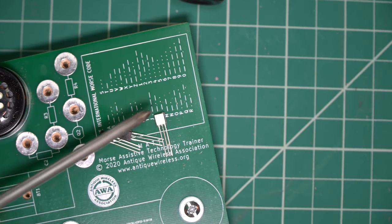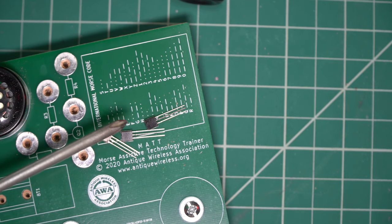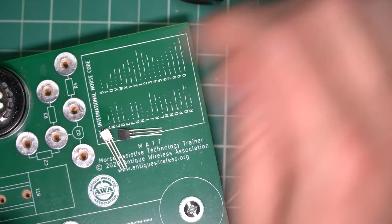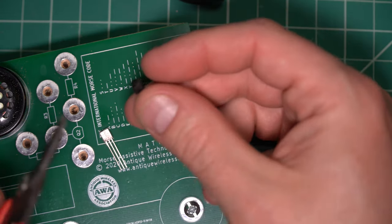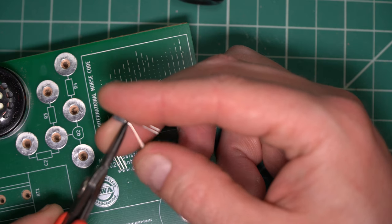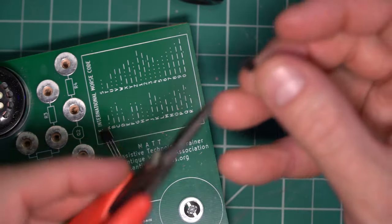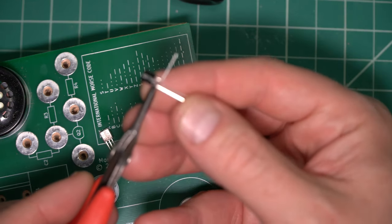This kit comes with 3 transistors, so you don't have to worry about picking out the wrong part when you do this next step, but this next step is kind of important that you do correctly. These need to be bent in a very specific way, and it's not the same for both of them. You're only gonna use 2 for this, so take your other one and put it aside somewhere you won't lose it. All right, so the process for this, and do follow the images while you do this, but you're gonna grab one of the legs here and you're gonna fold it directly out and away so that it can sit flat. Be careful here because once you start bending the legs like this, you will get to a point where they are stressed enough and you will not be able to bend them again. So try to do it one shot and then that's it. Don't mess with it anymore.